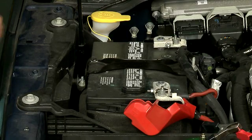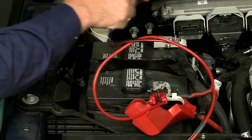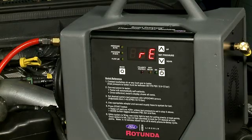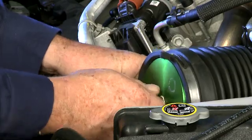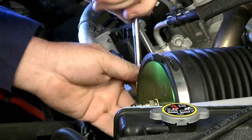To begin, connect the tester to the vehicle's battery. Connect the positive terminal first, then connect the negative terminal to a known good ground away from the battery. Within 20 seconds, the tester will automatically run a self-test and self-calibrate. Once calibrated, the tester's display shows all zeros. Next, using the correct turbo adapter from the adapter set or another appropriate adapter, connect it to the intake and make sure that you tighten the clamp until it's snug before applying pressure.